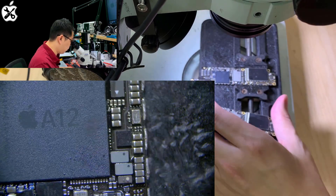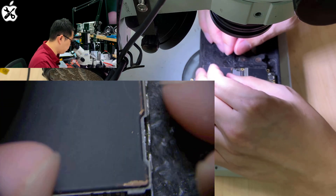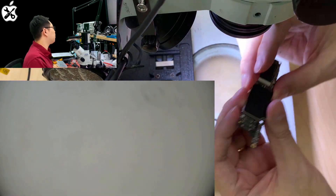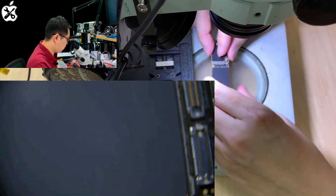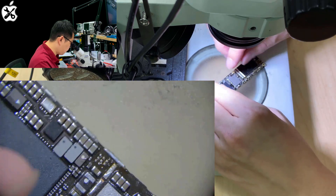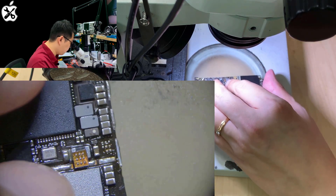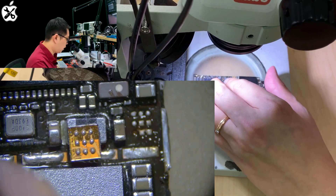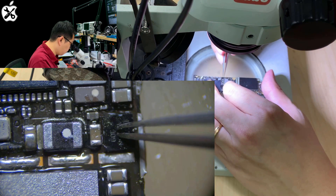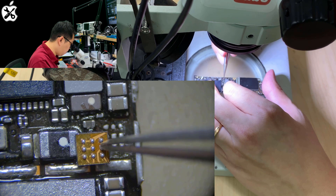What happened to this device is most likely either a heavy drop, or someone opened the shield from here — because there's a shield under the CPU. Maybe they wanted to fix something and accidentally damaged the EEPROM located in here. When the shield was brought to us, it seemed like everything was fine, but after I cleaned the glue, I found out there's a little dent.